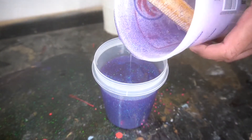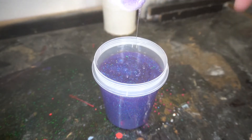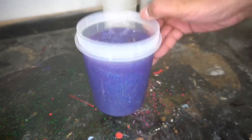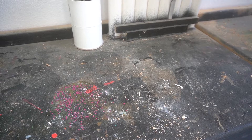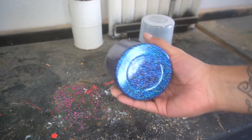We're taking it from one quart container and pouring it into a different quart container. Usually what happens is I don't mix the epoxy well enough and it ends up sticking to the mixing pot, so it's better to mix it in one container and pour it into another — once you get it out of the pressure pot it can stick. Four and a half hours later, into the pressure pot, we've got this cool nice casting that fell right out of the mold.